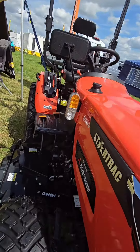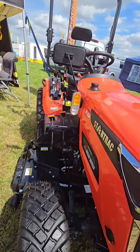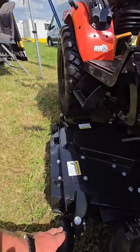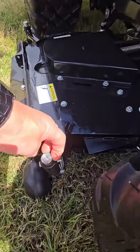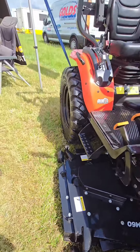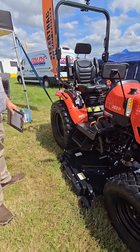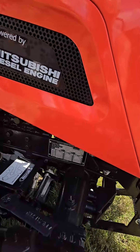That's quite low when it's cutting - that's right down on the deck. You'd have that lifted up; you would never be down at that. So the anti-scalp - can you drop that low? Oh yeah, you've got pin holes here - take the pin and drop the anti-scalp down lower. And you've only got one either side? But then you've got the tractor. It's just if kids get their fingers under there.